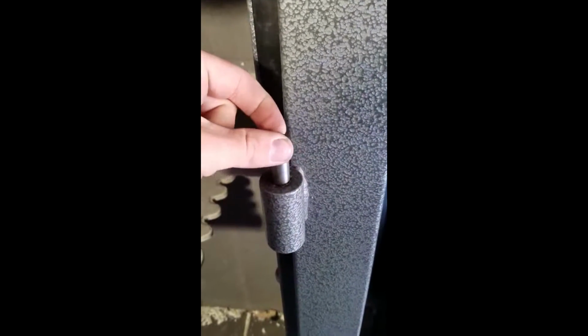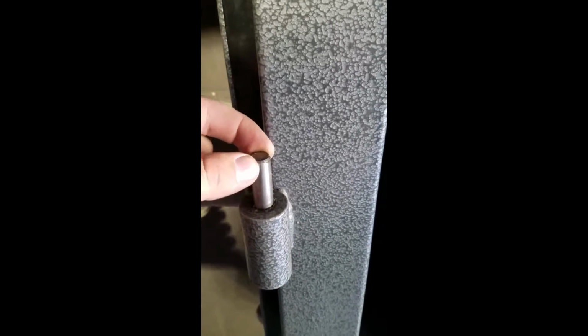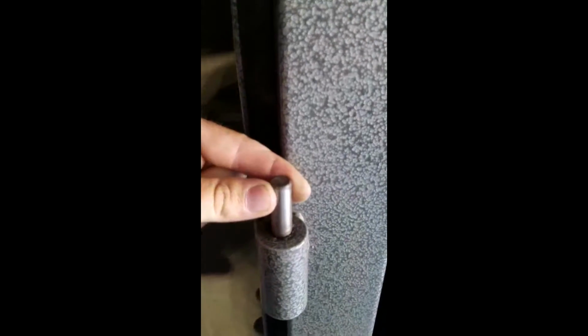One is this hinge pin starts to wear out as time goes on. The other thing that can happen is the pin will actually surpass the lubrication that's been installed from the factory. On much larger safes, the door is never going to come off. It's just far too heavy with your big TL30s, TL60s, and giant store safes. The doors themselves can weigh over 1,000 pounds. But what can happen is that lubrication will seize up, and the pin then starts to seize to the door and to the hinge, like so.